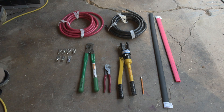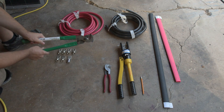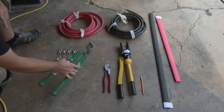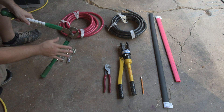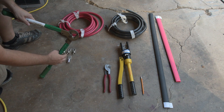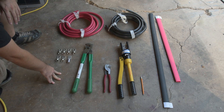For cutting the cable, I use this Greenlee 718 heavy duty cable cutter, 18 inch. This cost me about $75 — I bought it through a local electrician shop, but I should have bought it on Amazon because it was actually cheaper. One thing about this tool: the jaws, when I bought them, were fairly dull, and when I cut my cable it would round over the end. I took a flat file to the top jaw and a round file to the inside jaw and sharpened it, and it did appear to get quite a bit easier to cut after that. That may damage your tool — do that at your own risk.